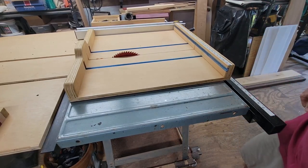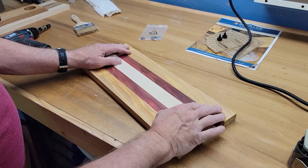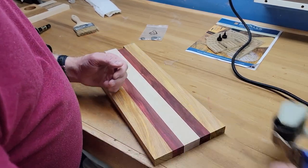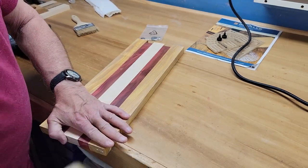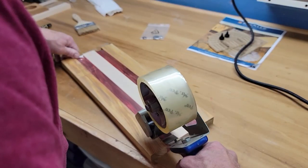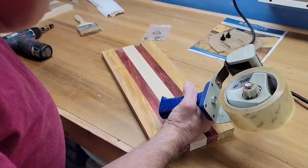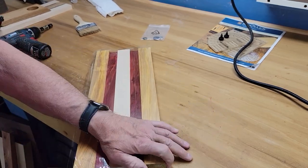On to setting up the templates. I've watched several videos on YouTube showing how guys try to prevent tear-out drilling the holes. Some guys use blue painter's tape. I've tried that. I find the painter's tape to be too sticky and it clogs up the drill too quickly. What I've done and had good success with is just use packing tape. I put the packing tape on the top - it allows you to see the holes, and as the drill comes down, the drill will cut the tape first. The idea is that if it's cutting the tape, it's not tearing out that first little bite of wood. Different woods respond differently to the drill, just like sanding. I've done this on a few boards already and it works fine, though it's no substitute for sanding.